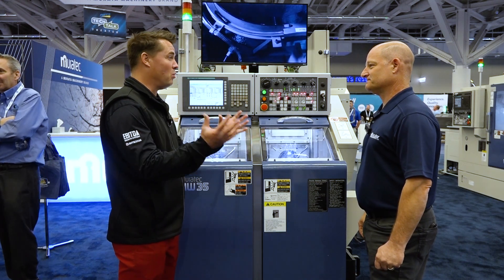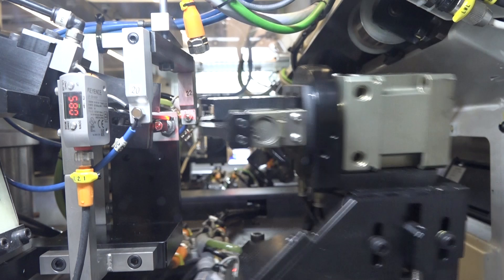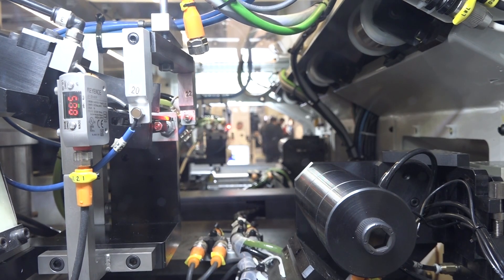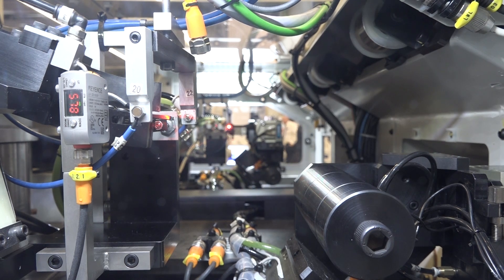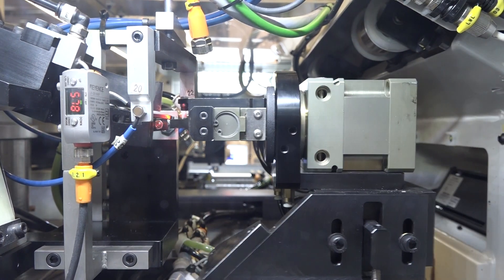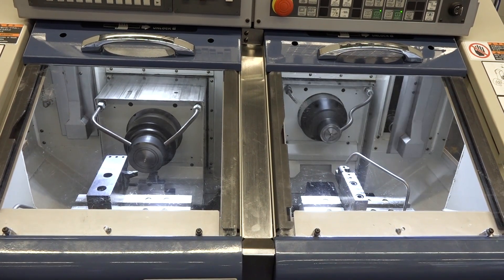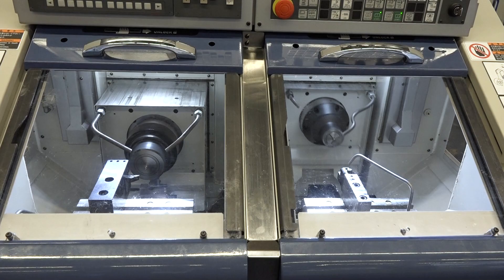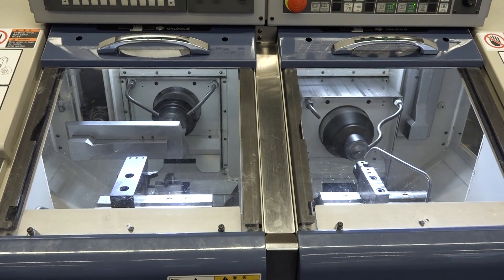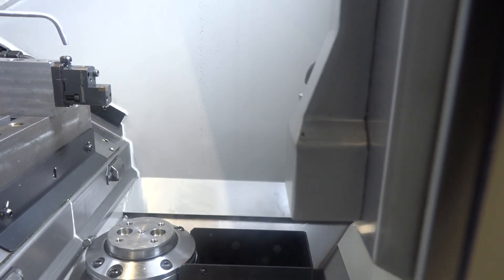The parts area of this machine — I think of the bowl in the back that you just throw parts into. You can just drop parts in and it's going to sort it all for you, and you can see how fast it's moving right now. In my world, when I piece this together, I think about that one operation or two operations that are complicated to do inside, when you've already done 30 other operations inside the machine. It's just that one drill hole, that one whatever it might be, repeated over and over — that's why it's so successful in aerospace and other industries making so many parts.